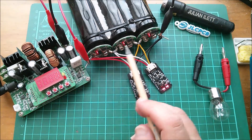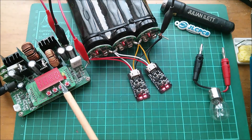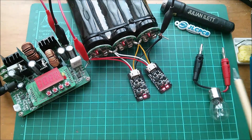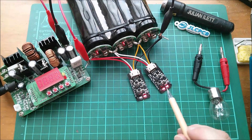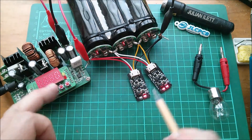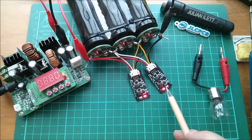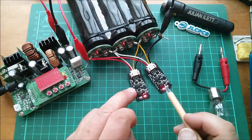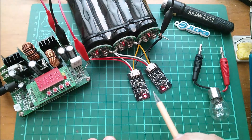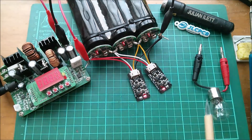I've turned off the power supply; these three lights are going out gradually. When this is finished balancing and I switch the power supply back on, I'll see whether all three capacitors hit their 2.5 volts together. There's an interesting situation where this one thinks it needs to transfer from cell three to two, and this one thinks it needs to transfer from cell one to two — so the voltage set points on the two devices are slightly different. Maybe they're interacting a little, but that doesn't really matter. The more you parallel them, the more that gets smoothed out.